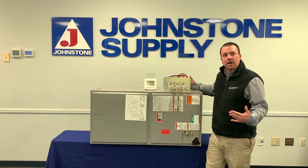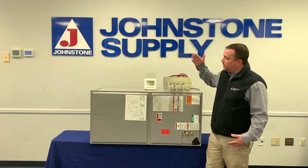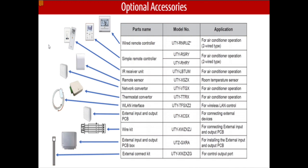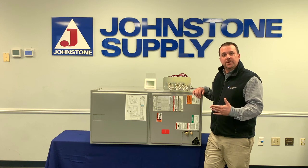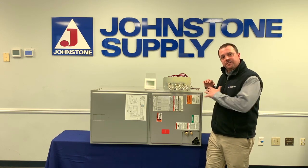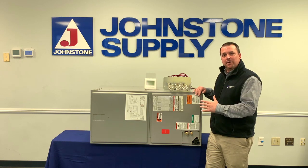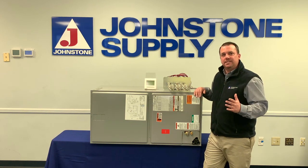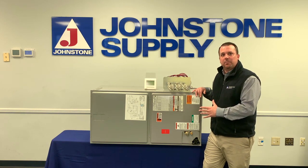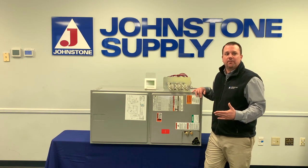We can use a couple of different accessories on this unit — the heat kit, as I mentioned, and we also have the wired thermostat, which is what we recommend. It's going to be more traditional, like what people are used to for the unit you're replacing. The niche for this unit is that it's using existing ductwork. Up to one inch of static on this motor, it's fully variable speed, so you don't have to make any CFM adjustments. As long as you're under an inch of static, this unit is going to provide the proper CFM for the application.